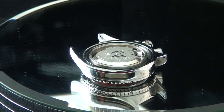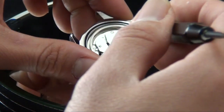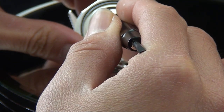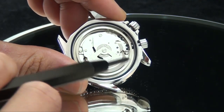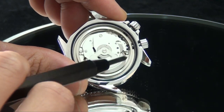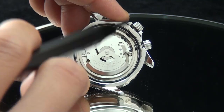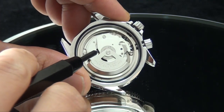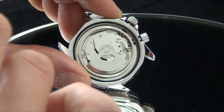The second question: is it true that Orient automatic movements don't have manual winding because they're self-winding and more efficient without that mechanism? Yes and no. Orient watch rotors are slightly louder because there's a ball bearing system inside. That ball bearing system takes much less energy for the oscillating weight to move, which is why it's such an efficient self-winding system.